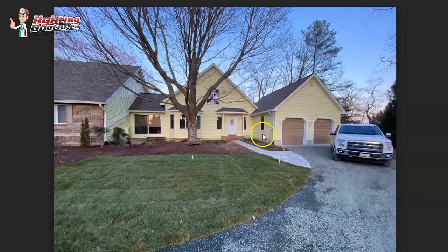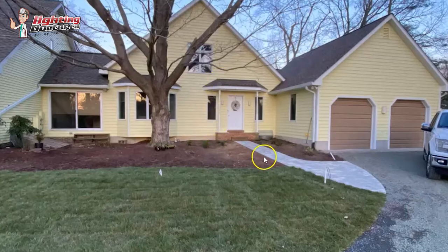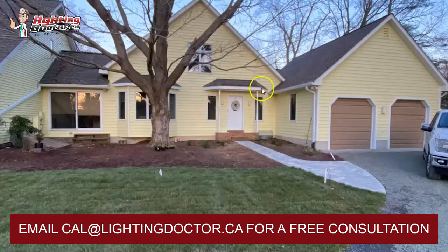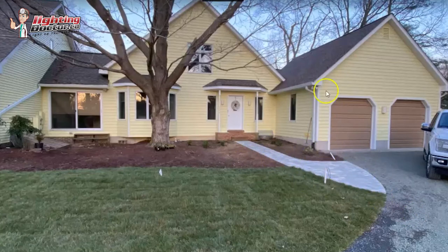Use a slightly smaller in-ground light at the base of each column — maybe about 12 inches back, shooting straight up to really highlight the garage peaks. Then keep that same theme across the house. I'd definitely try and get some accent lights to light up the entryway, just in front of these pillars and bricks here — maybe 12 inches back, straight up. When the light hits the top it spreads and creates a nice lit archway, making that front entrance really inviting.